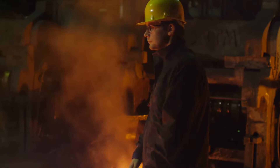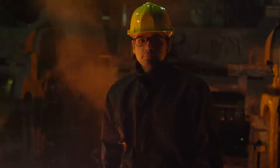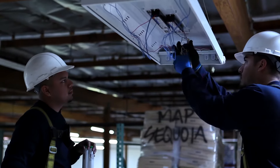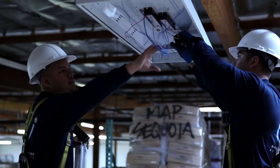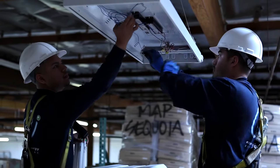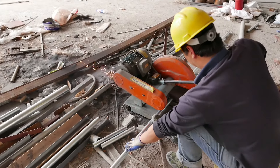There are more types within Type 1 and Type 2 by electrical insulation rating. Class G hardhats protect up to 2,200 volts. Class E hardhats offer the best protection, up to 20,000 volts. Class C hardhats have no protection against electrical hazards.